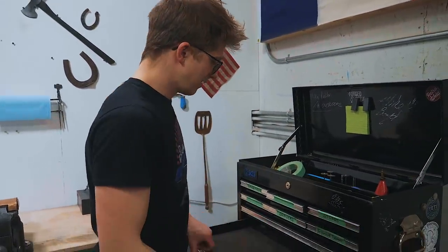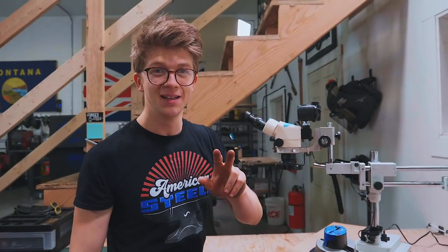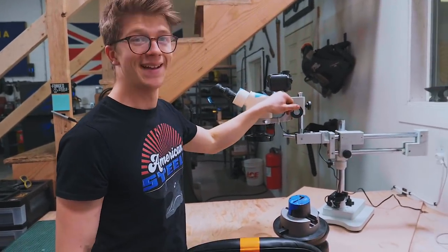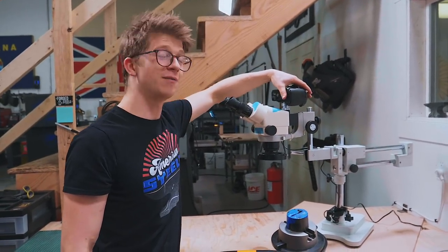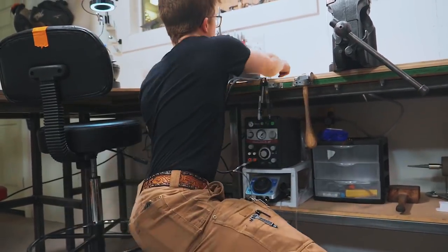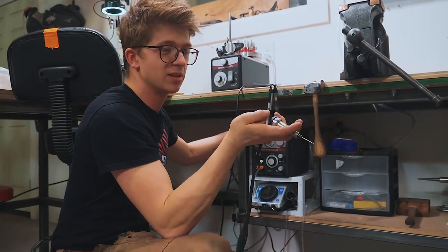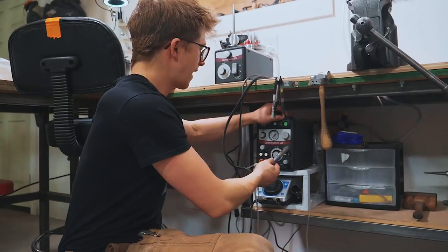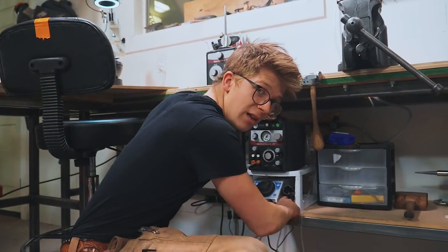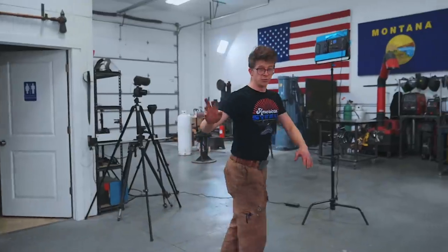We've been investing time and effort in storage, and I'm thrilled these boxes still have empty space because as the number of tools increases we're going to need to find a place to store them. This toolbox that I've been using is now mostly engraving and jewelry work — small fine work — and there's plenty of open space. Over here we have our microscope — actually a trinocular microscope. There are two tubes for looking down and one tube where we have a Panasonic GH4 connected to film footage from the microscope. Below the bench we have my micromotor control unit, the handpiece at the top, and the control unit for the airgraver, which can be palm- or foot-pedal-controlled. The airgraver unit also powers my little turbine handpiece via compressed air — the 320,000 RPM one.